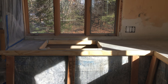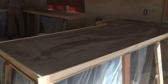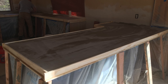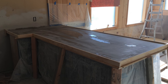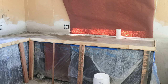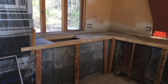We took some two by fours and cut them a half inch taller than the height we needed them, and we wedged them underneath the countertop. There was enough pressure to hold the forms in place. We stapled the two pieces of plywood together using a battery operated staple gun. I'll leave a link down below on Amazon to a Dewalt one — we were using a Ryobi from Home Depot. That worked really good; it works a lot better than using a brad gun and held the forms together, making them a lot stronger.